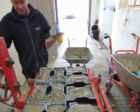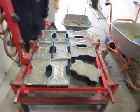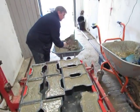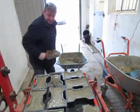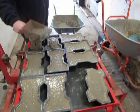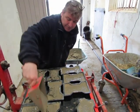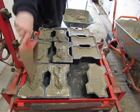Moulds fill — turn the handle. Any load needs topping up. When we vibrate the concrete it allows the air bubbles to rise to the top, hardening the concrete. Top up. Another turn.